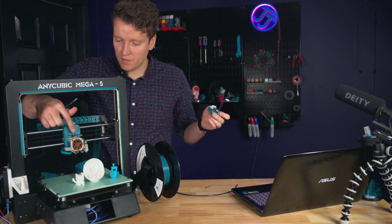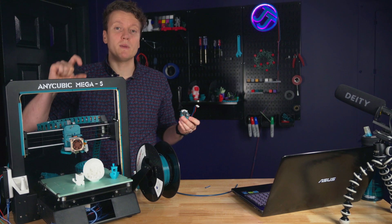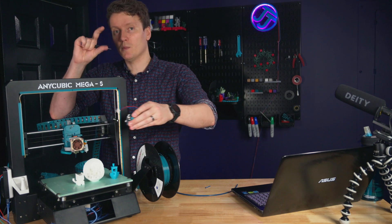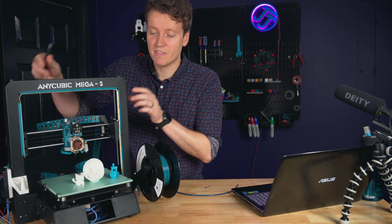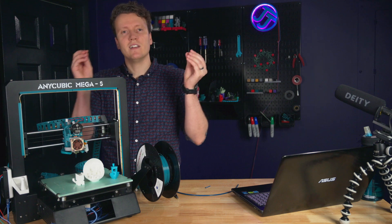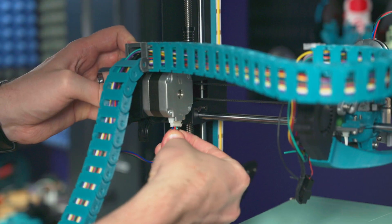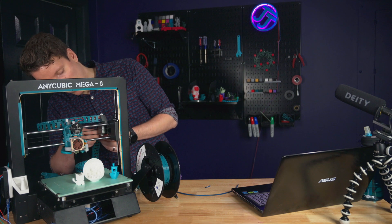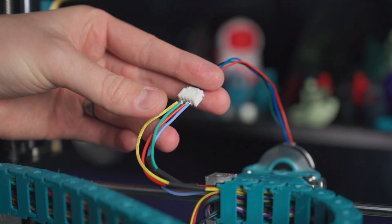For installation, I have a 45 millimeter PTFE tube in there — that's what worked for me. I recommend cutting a little more than you think you need, then slowly trim it down until it fits snugly. Wiring is another thing to deal with: I cut the clip off at the original extruder motor location and spliced on wires that run up through the cable chain to the extruder. On the other end I added a little connector to make it easy to unplug when removing the extruder.